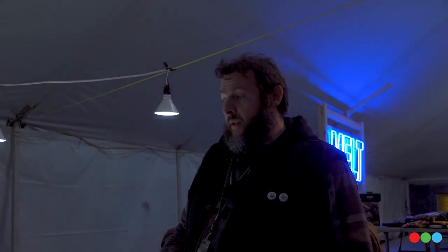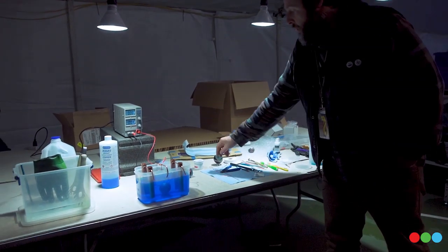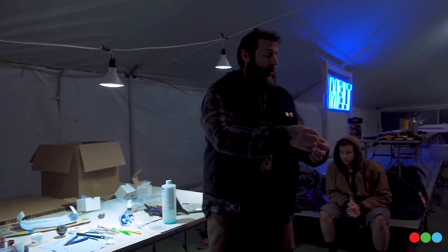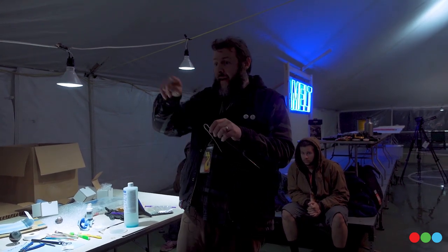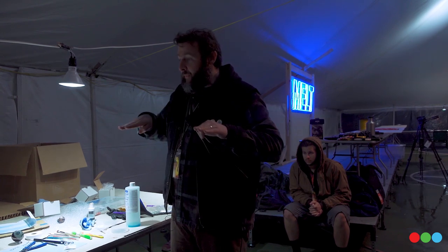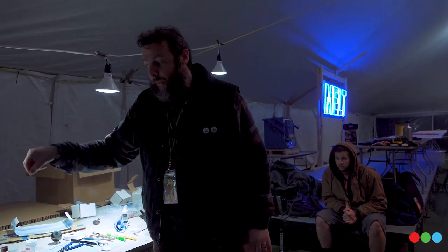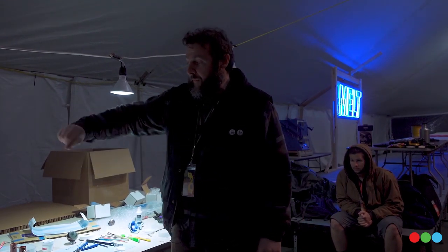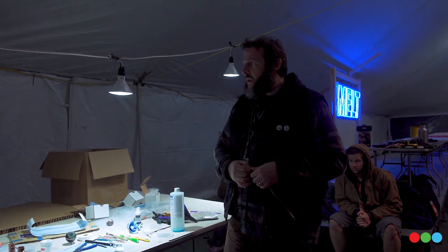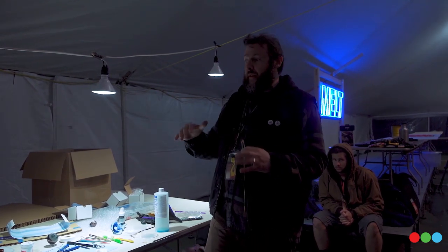When I did the Zach Jorgensen blade, and a blade had to sit in there on its side, I used wire, basically like out of here, but I left the coating on it. And I just bent nice little shapes so it sat in there really nice. And then I used electric tape and taped those down really good onto the bottom of the bath, and it locked it down really well. That worked great, and it also allowed me to flip the knife if I needed to. So a lot of it is in the preparation of what you're doing, to get it to set in your bath well, get that wire to touch down nice without things shifting.